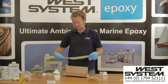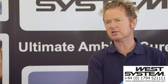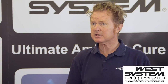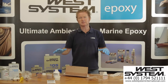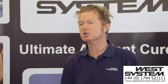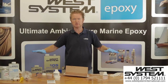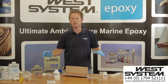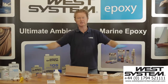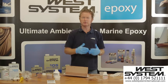There's another side benefit to using Peel Ply, and that is something we refer to as amine blush. Amine blush is easy to remove. You can remove it with warm soapy water, or we have a dedicated West System cleaning solution. Once you've removed it, then you have the ability to sand the surface. If you don't remove it, the waxy bloom or blush will clog your sandpaper, and you'll distribute it over the whole surface area of your work. Very, very undesirable, because another coat of epoxy won't take to that surface, or another coat of paint will be disastrous on that surface. So you must wash an epoxy coating before you sand it.